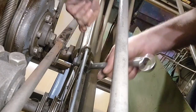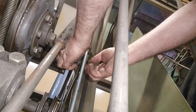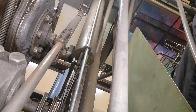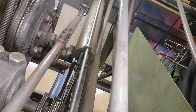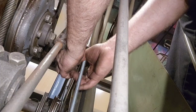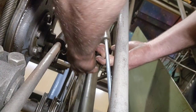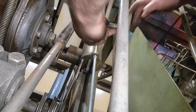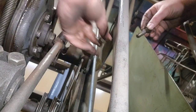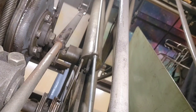Hopefully this thing will separate easily. Sometimes they do, sometimes they don't. Interesting - copper washer right there, that's not normal. What is normal anyways? That came off pretty easy. In this case the bushing came out with the bolt - that's not awesome. The bushing is supposed to be a press fit in there, but not today.